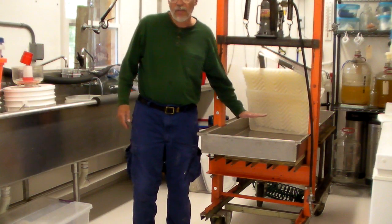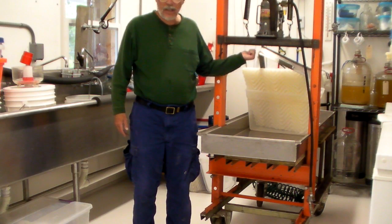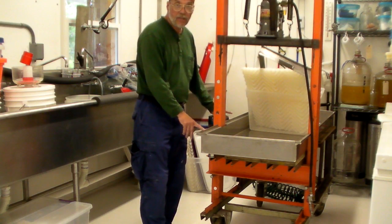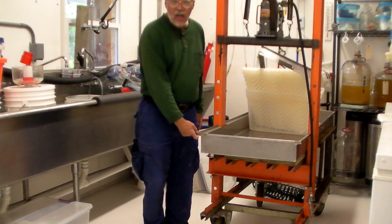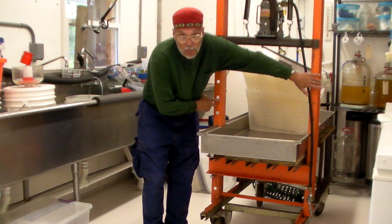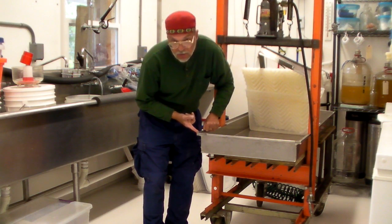When you're pressing down that cheese, fluid will build up and you want to have room for that to go — but you don't want the sides so high that it's difficult to press and you're limiting the travel. I'd give it five inches on the sides only, not in front. You've got this turned lip: the lip is a half inch high and it's a one inch shoulder. So the inside is your arbor minus a quarter inch, and you're going to add another inch coming out for the shoulder, then go up a half inch. Don't forget — these are rolled and sealed.